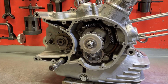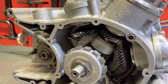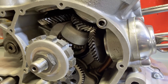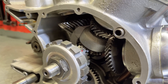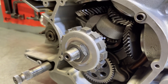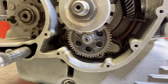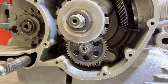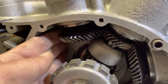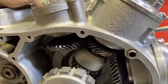That makes the distribution for this engine now complete. We have the front, rear, and center bevel all set up with the gear from the crankshaft in place as well, and it is all lining up. The oil pump has also been fitted together with the driving gear, and as you can see we have no backlash — as we should not — and it runs smoothly.